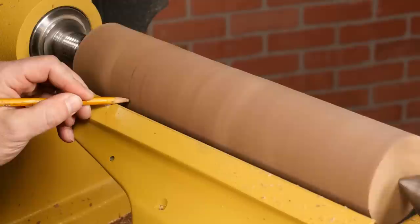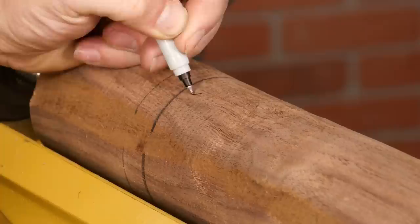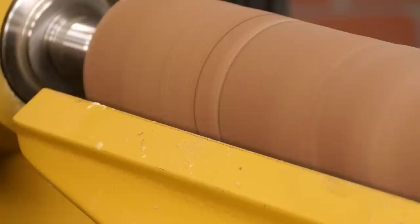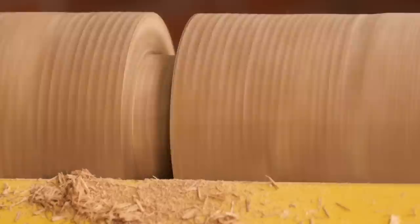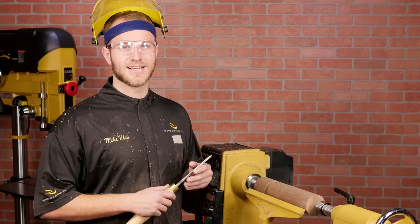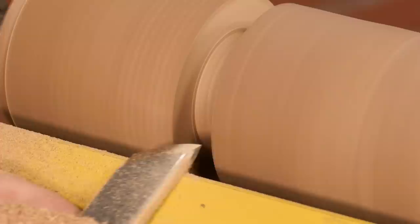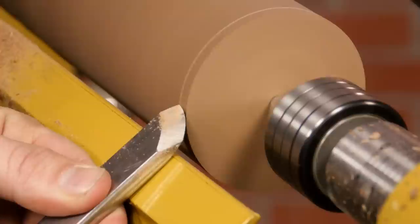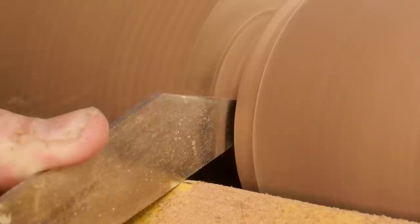Make sure to mark out a half inch between the head and the body for the spigot, marking the boundaries and labeling the mill body to keep track of grain alignment. Cut a half inch wide spigot approximately 1-1/8 inch diameter — this creates a spigot that will fit into the mill body later. Now we're going to cut 3 different tenons that will be used for holding the mill at later stages. Each tenon will be cut with a skew laid on its side: cut the first on the headstock end of the mill head, and the other two tenons on each end of the mill body. Once our tenons are cut, use a narrow parting tool to part and separate the mill head and the mill body.